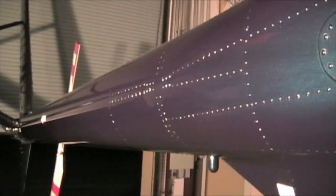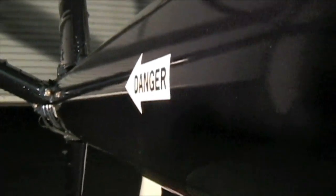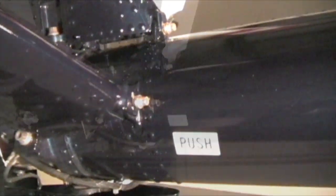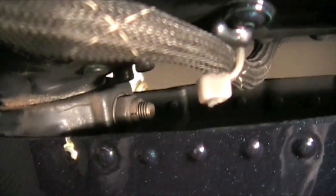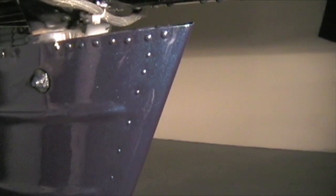Walking down the tail boom, place your hands on the top and bottom and just run your hands all the way down. You can also get a good glare going down the side of the tail boom to see if there's any dings or especially any dents. Here we have your lower portion of the vertical stabilizer — it attaches right here with two bolts, one that goes all the way through and the other from the back side. Check to make sure it's not bent and there are no big dings in the leading edge.